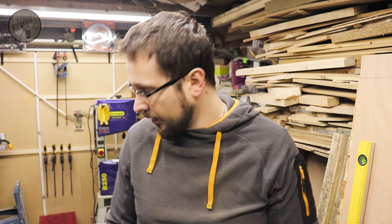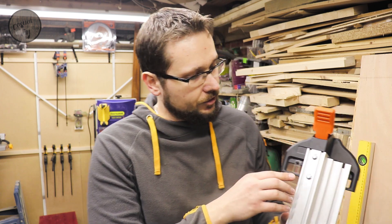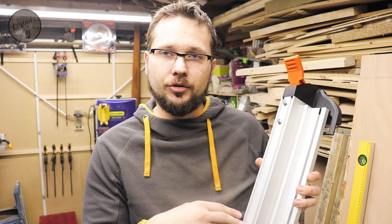So far so good! To be absolutely honest with you, I was expecting that some tuning would be necessary, but by the looks of things everything's fine. You can also adjust your fence if it's not square to your blade — there are two bolts that you can release and then adjust the fence itself, making sure you're actually cutting straight.